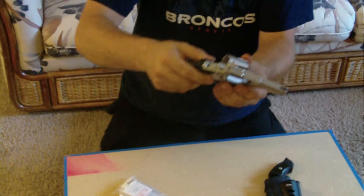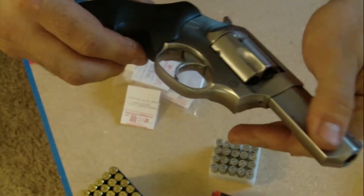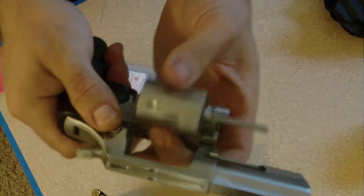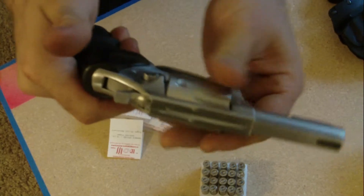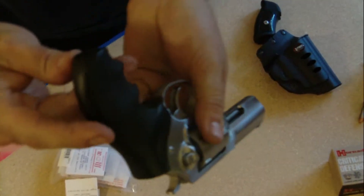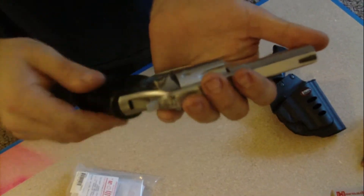I'll give you guys a little close-up of it. It's a five-shot cylinder — holds five rounds. It's got the full under lug right here. Some of the older revolvers won't have the under lug underneath, but this one has a full under lug. This one doesn't have the serrations on the spur. Functions pretty good — like I said, the trigger pull is great after that trigger job, and I put the Hogue grip on there. In another video I can show you how I did the trigger job — it took me about ten minutes, just replaced a couple of springs after taking the grip off.